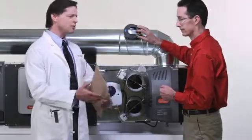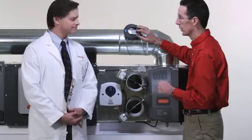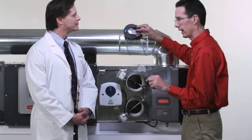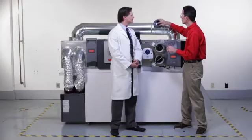So how can I make sure that all zones are properly set? Sure, it probably is, but you can be sure by making only the smallest zone call for a fan. When it does, the damper will open — and listen. When the register is quiet, it's set properly.